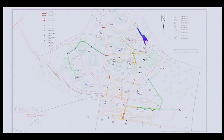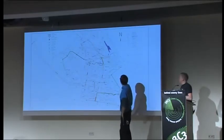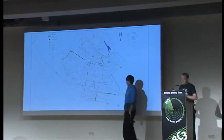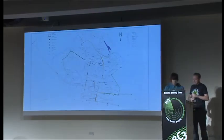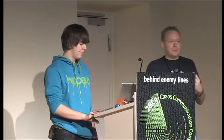The blue things are all the data closets. We had three cable bridges and rerouted some things because certain areas needed 10 gig, so we laid an extra fiber around the angel area to our data center. We did around 120 fusion splices because we bought the fiber on a cable, laid it in the ground, cut it, and had to make pigtails on it to plug into switches. It's obviously quite a difficult environment to install fiber, and splicing is quite a laborious task.